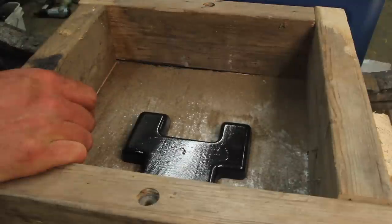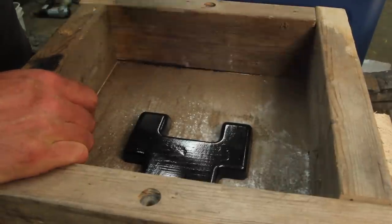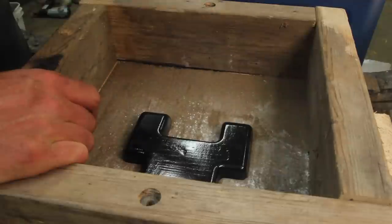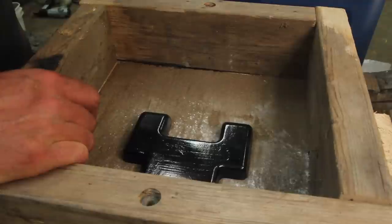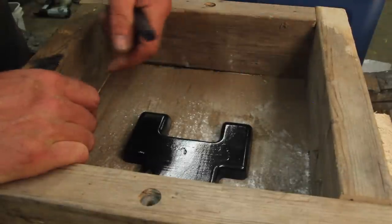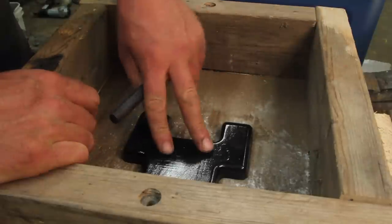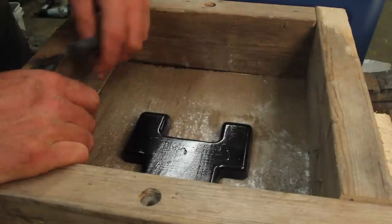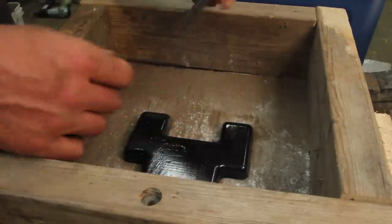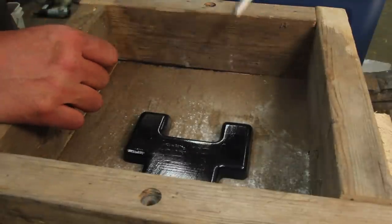Saying your sprue is too big without any explanation of what that means or what that does is not as helpful as saying you want to keep the sprue full so that air and the aluminum oxide film doesn't get mixed in with the metal as it's feeding into the mold. And if you can keep the sprue full, you'll end up with a higher quality casting with less porosity. That's more useful.